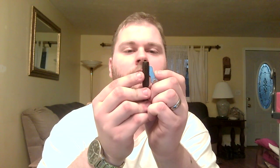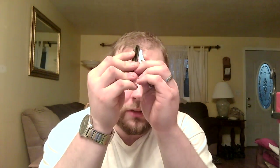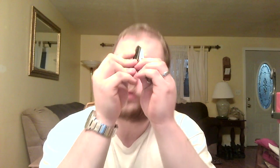And that is a pretty good match right there because you don't see any light in between them. You always hold it up to the light and see if you can see any light through them. And if you can, you got the wrong size. But if you look real good, it'll tell you exactly what it is. And this one is a 1/2 inch. And so is this tap. This is a 1/2 inch tap.